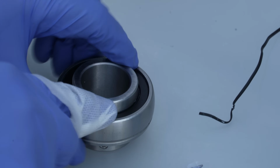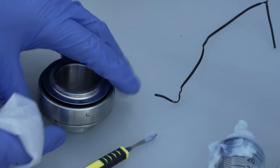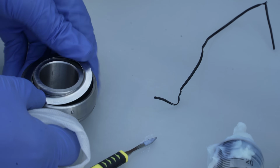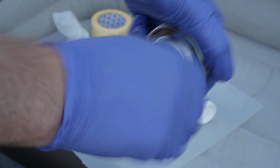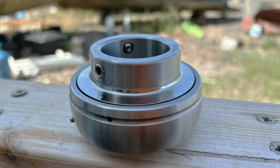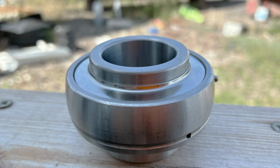Not entirely sure why. The shield is trickier as it's thin and easily bent. Since the fit is so tight, it resists as you push and push, then pops on rather abruptly. My best tip is to push it on with both hands all around and using as many fingers around the circle as possible. Pretty happy with that, all sealed up and ready to go back in the housing. Can't hear anything. No scraping or sounds of distress, and here we go. I do think the shield is seated a little low, but I don't think it'll make a big difference. I'm certainly more likely to cause more damage by removing the shield and trying again.